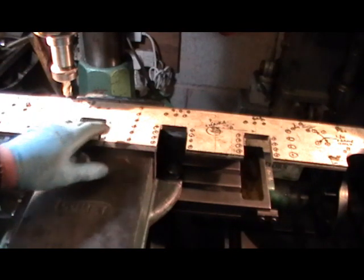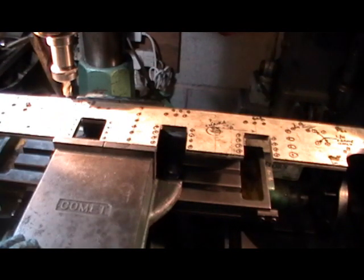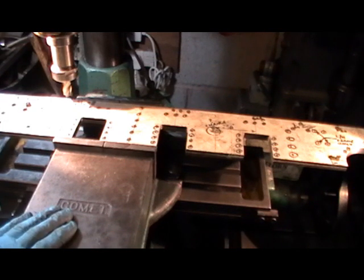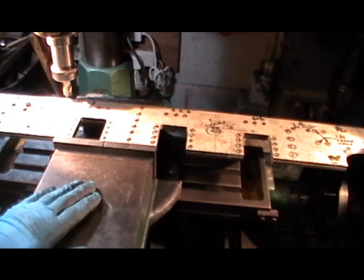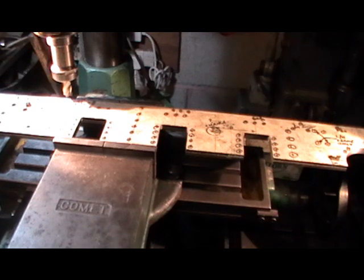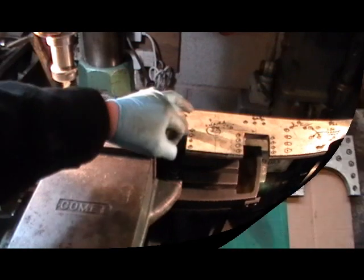If you haven't got a milling machine, don't worry. You can either cut them out and file them, or use a milling attachment in your lathe and do them individually that way. My miller isn't a fantastic miller — it's just a basic hobby miller and I have to shift things around on it anyway because it's fairly small. So it's swings and roundabouts. If you've got a lathe, put your vertical slide on and put your vice on, or clamp it to an angle plate, and do it that way.